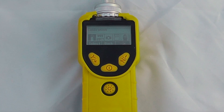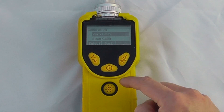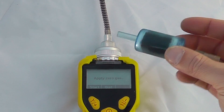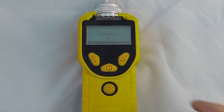Our first option is calibration. To start the calibration function, select and we get an option for either a zero calibration or a span calibration. To start with, we'll do a zero — press select. This will then say to apply zero gas. All units are supplied with a carbon filter to ensure a clean VOC sample. Press start and it will take a 30 second zero. That zero reading has now been successful, setting point one of our two-point calibration.